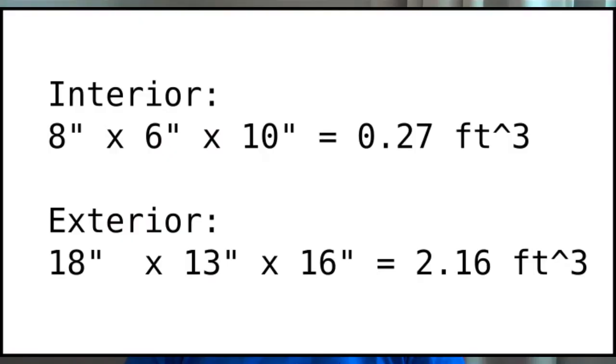Unfortunately, the outside is 18 by 13 by 16 inches because I went overboard on the insulation. That's 3,744 cubic inches, 61 liters, or about 2 cubic feet. You could actually buy a small dorm refrigerator that's just about the same size as this, have a lot better coefficient of performance, a lot more volume to refrigerate inside. It would be 120 volts instead of 12 volts, but you could power it with a small inverter if you wanted to.